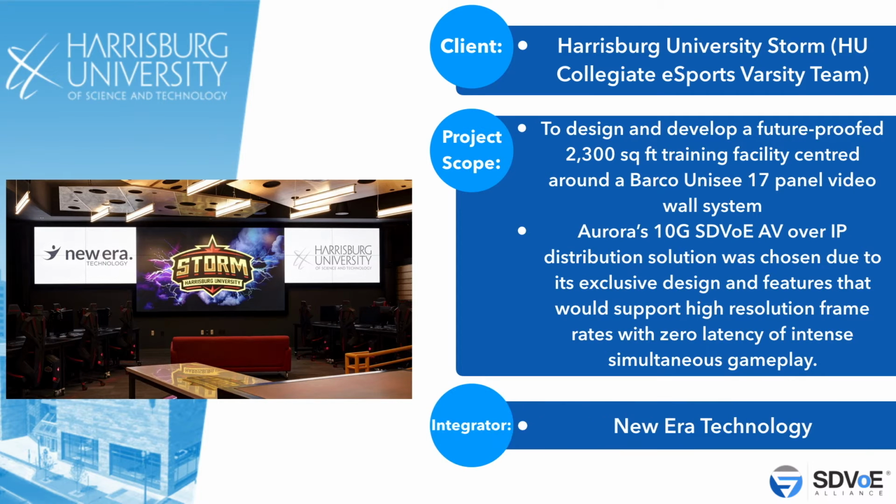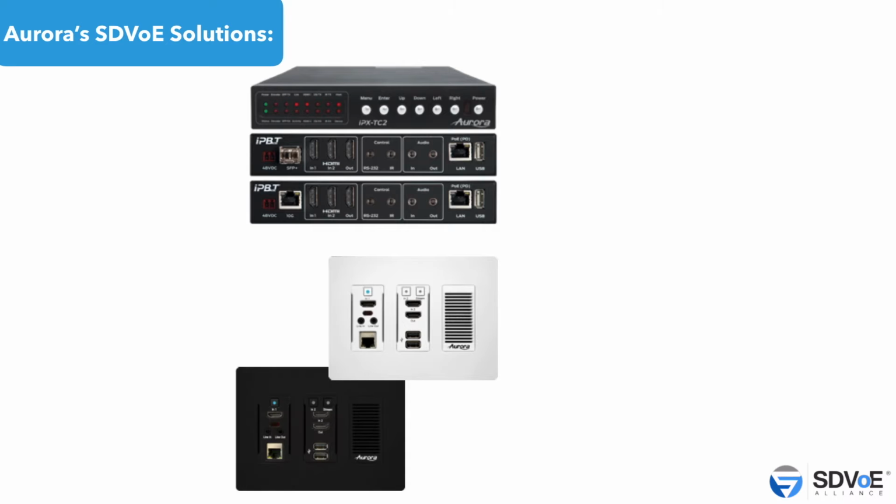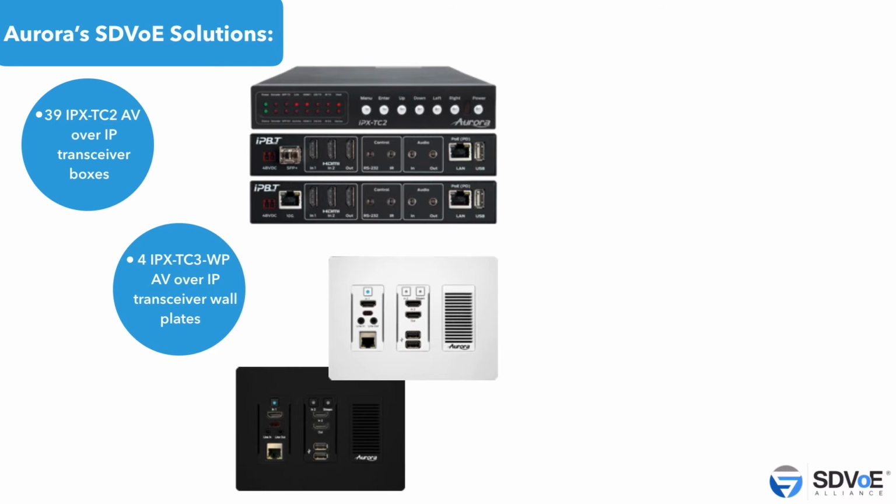So one of the things about this installation is we were able to not only use our box versions but our wall plate versions as well. So in this installation we did 39 of our IPX transceiver boxes. Aurora happens to use transceivers, which means we can do transmitters or receivers in a single box, lowers the SKU count, and we also used 4 wall plates for the remote interfacing if they brought in any additional equipment. We also used some Dante cards in there to move the Dante data over the 10 gig, which then went out to the Dante network.